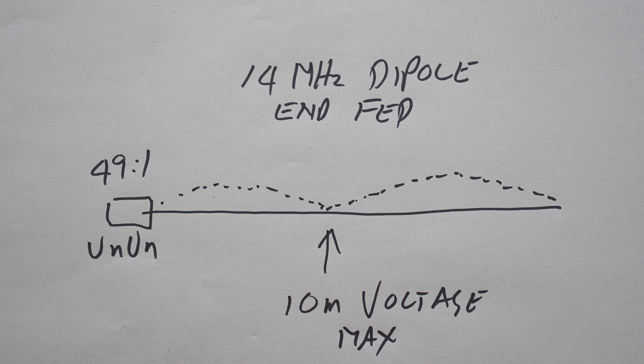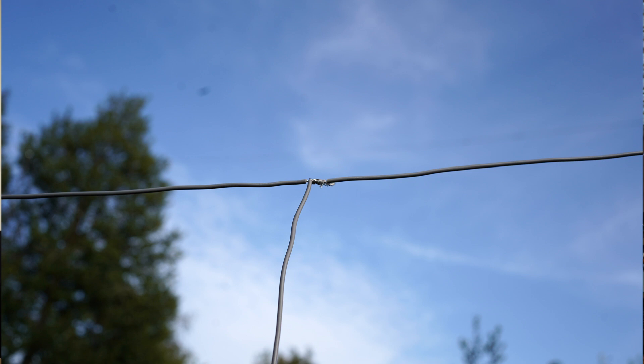It is the voltage point that is most sensitive to any changes. So if you hang a length of wire at that voltage point — halfway along the wire — you'll find it drags the 10-meter resonance down. It has much more effect on 10 meters than on the 20-meter band. By adding around 18 inches of wire to the center of my 20-meter half wave, just dangling down, I lowered the frequency dramatically on 10 meters with minimal effect on the 20-meter band.